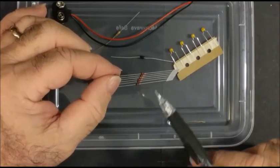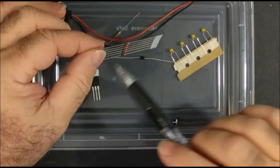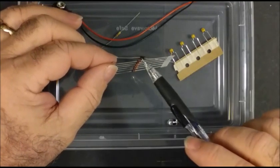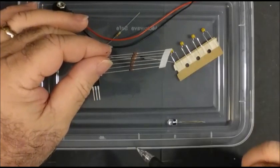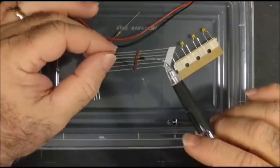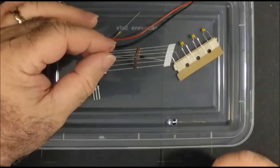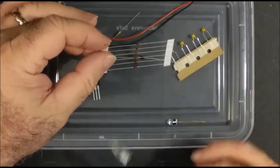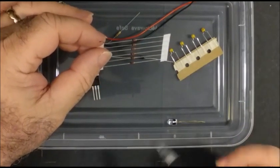We will handle 9 volts without a problem. What's really cool about this is these will not turn on as long as the voltage regulator is working correctly. If you were to hook your battery up directly to the power rails for your chips, four of these will turn on because you're going to be putting four of them in. They'll protect your circuit from either hooking the battery up backwards or in the wrong place — they'll make your 9-volt battery act like a 5-volt battery. Your battery will get hot, these will get hot, but your chips will survive.